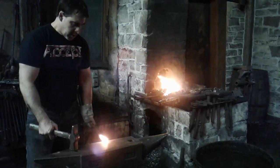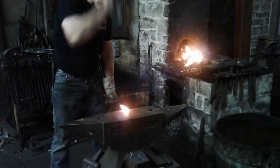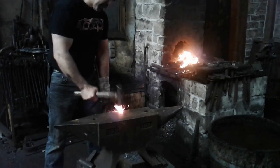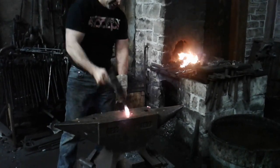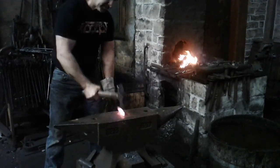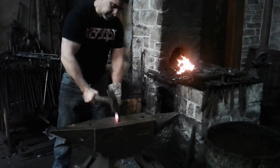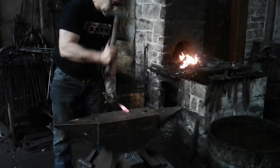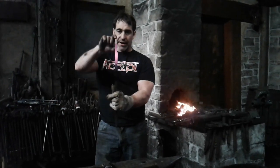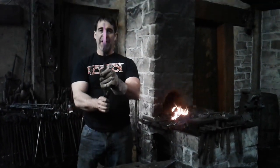The first step: you start on the inside edge of the anvil and I put about an inch on, hitting with the hammer half on and half off. This is very important — the hammer is half on here and half off the anvil. That technique gives you the control to be able to make very crisp notches. So that is notch number one. I've taken it down about half the thickness and made a notch — you can see it's drawn out as we've been hammering it, so it increases in length.